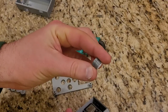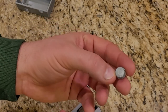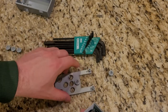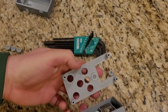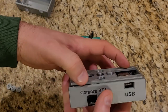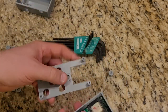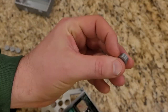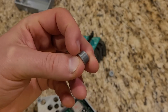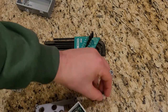I started remodeling this in Fusion 360, which is really getting my Fusion 360 skills better. I modeled a cylinder and just made that collar shorter — same size — but even with a shorter collar I was unable to get this to sit flush. I went down to a 1.2 millimeter collar, and that's about as thin as I like to print if I want any strength in the material, otherwise it gets really flexible.